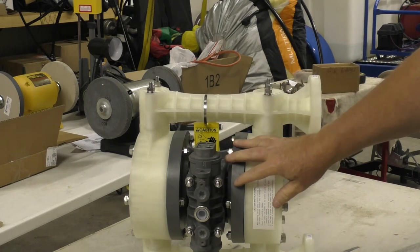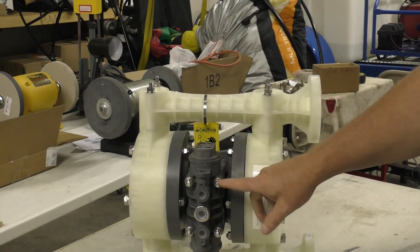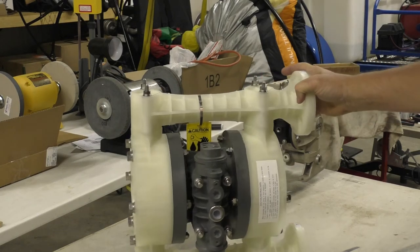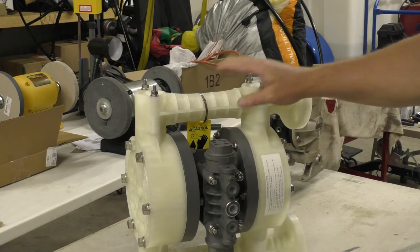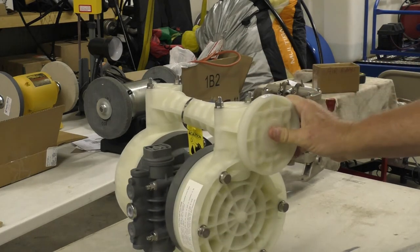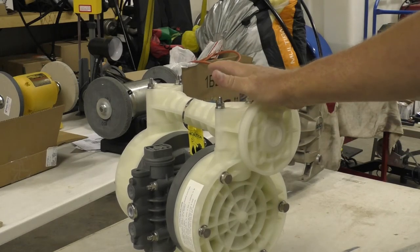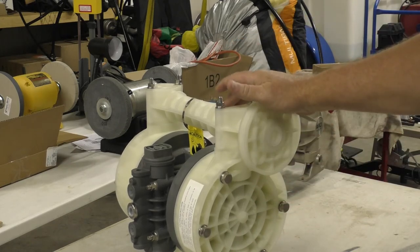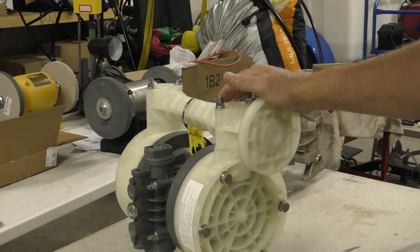Other than that, it's got the polypropylene body and the aluminum air pump, which does not like moisture, and they use a lot of air so you're going to need a big air compressor for it. The valve seats, diaphragms, and check valves are PTFE Teflon, so that's good — it should last quite a while. It'll pump out something like 46 gallons a minute and has about an 18-foot lift on the suction. If you want to read the rest of the specs, just Google it up; I'll put the pump model in the description for you.